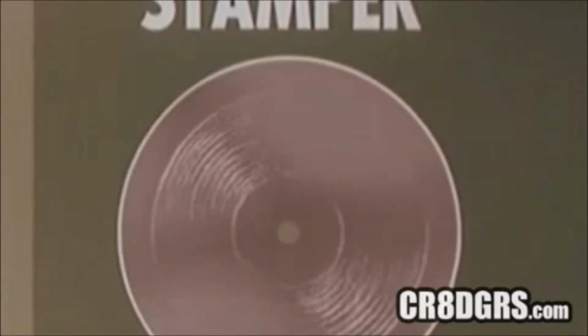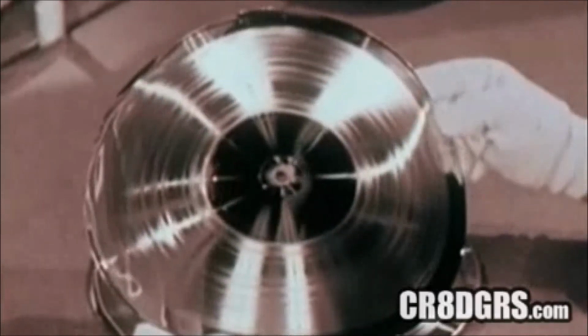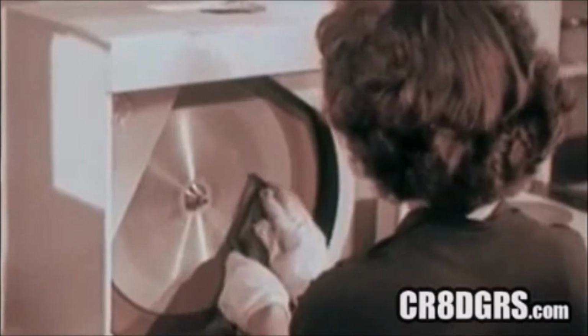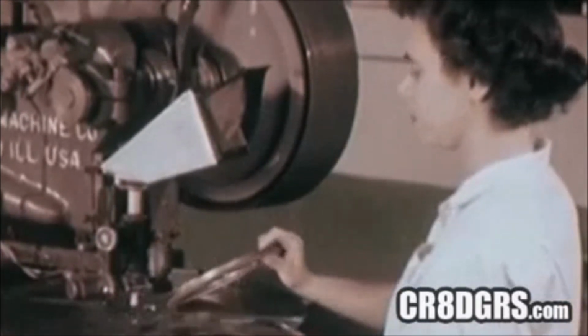The metal buildup to the stamper is exactly the same, except for one thing. The stamper is nearly all pure hard nickel. Its ridges press the playing grooves into the finished record. Now it's prepared for stamping. Ground perfectly smooth on the back. Optically center punched for the record press. Trimmed to exact diameter.